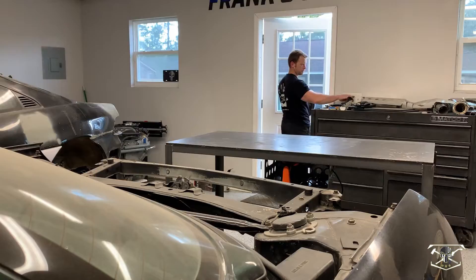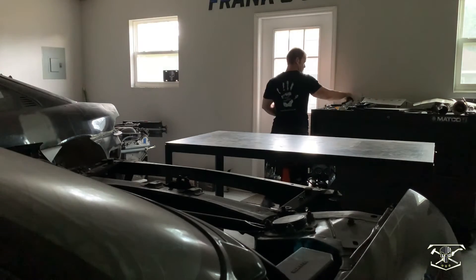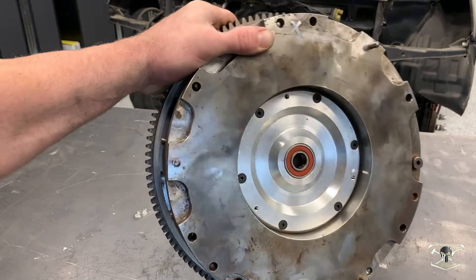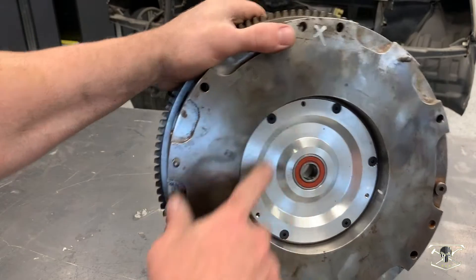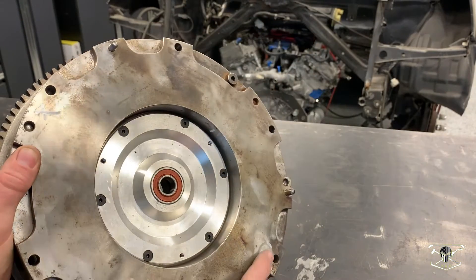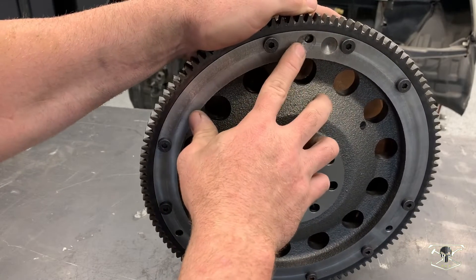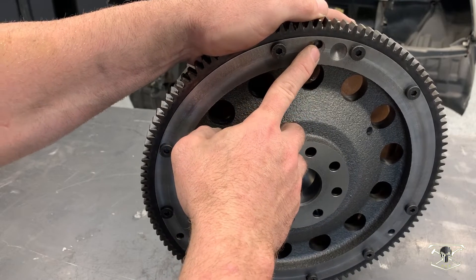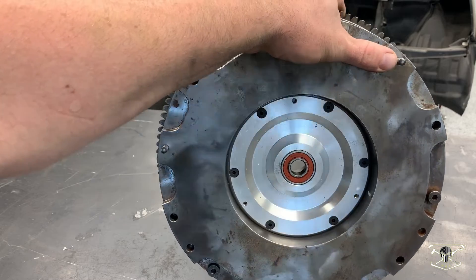Another trip back to the machine shop — and I got a quick turnaround. This is actually from the engine machine shop. You can see they rotated this thing and marked it here and on the bottom where the opposite side was. This is the side they had to remove some material from. On the reverse side, this is the original spot that lined up — right in that corner they took an additional three ounces out of it. So now we have a perfectly balanced flywheel and we can get back to building the adapter plate.